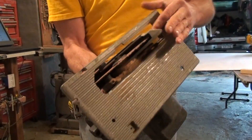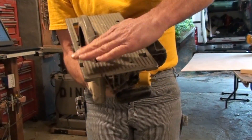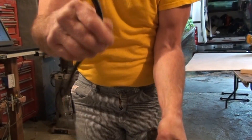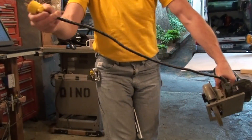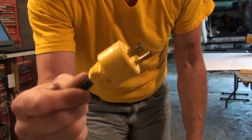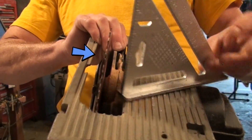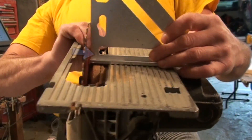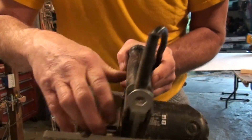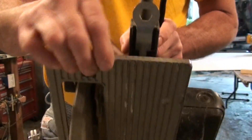Here's a plug-in, more powerful circular saw — same basic thing: you've got a blade guard that comes back as you make your cuts, and a shoe adjustable both in angle and depth of cut. One note: I actually cut the cord by accident — this is really supposed to be a seven or eight foot cord — but I spliced in a replacement end, thereby saving this circular saw. The carpenter's square confirms the 90-degree angle on the blade on this one. This one has a lever you pull up to set the depth of cut, then you lock it back down.